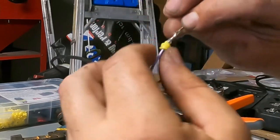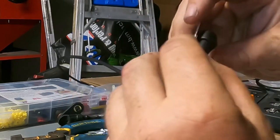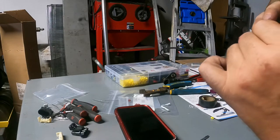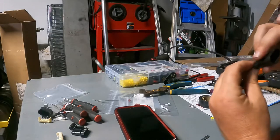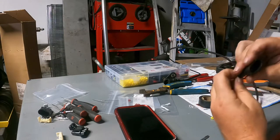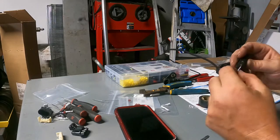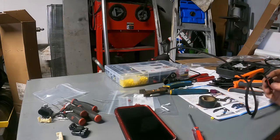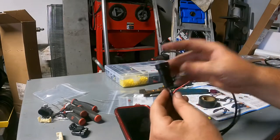And we crimp it — it crimps the isolator and the wire at the same time. This has got the stopper wings back here, and the wings need to go this side up. Boom. It's in there. Got my little screwdriver just in case. Yep, looks even — not coming off.